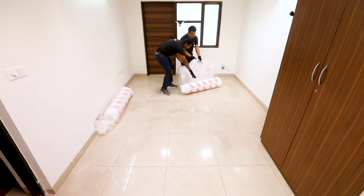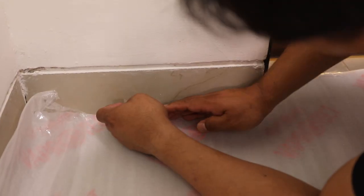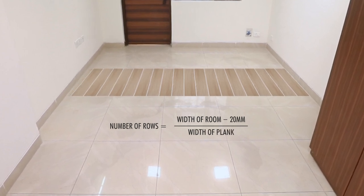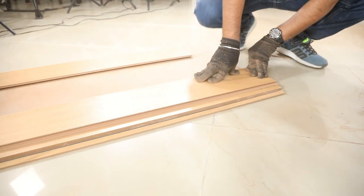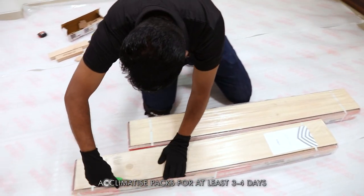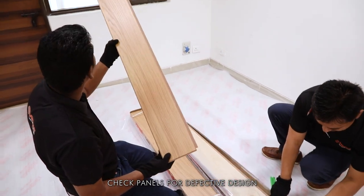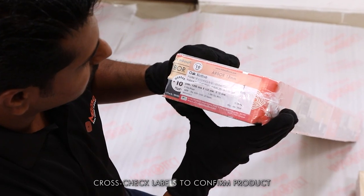You will also need nails, level meter, speed square, moisture meter, and PVA glue. Begin by cleaning the surface — vacuum the space and remove any debris. Then spread the Mikasa WeProtect underlay edge to edge and tape them together. Take room measurements and calculate the number of rows needed along with the perimeter gap required. If the last row is less than 70 mm, cut the first row of plank lengthwise. Remember that 10 mm is needed on all sides for the spacers. Open packets as and when required; packs need to be acclimatized for at least three to four days at the installation site. Check panels for any defect in design, surface, and Plank Lock joints — if you find any, do not use them. Cross-check the label on the packs to confirm delivery of the right materials.